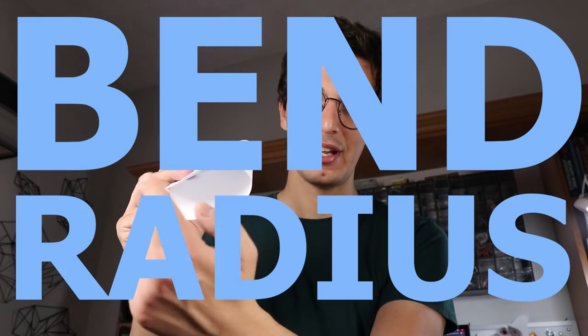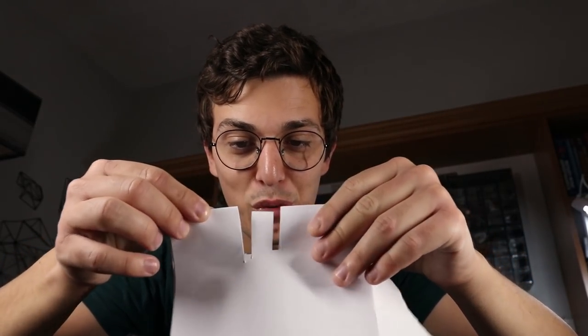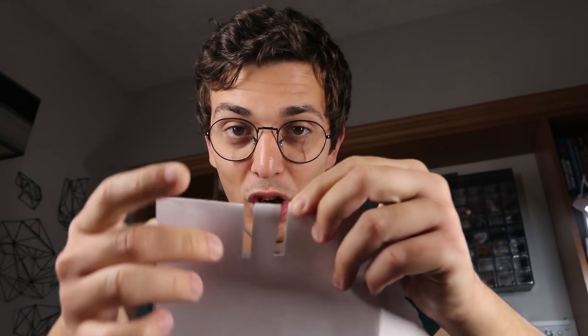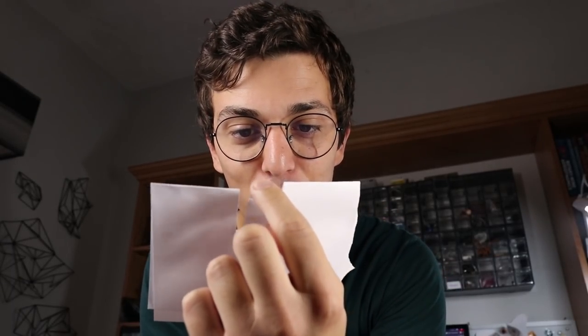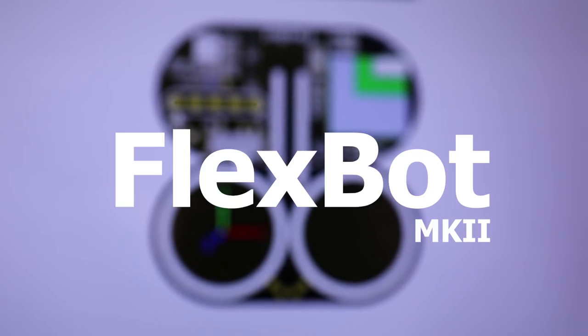We always need to have a bend radius. Here's where my breakthrough idea came about: what if these parts are folded and we have this little section where the tracks pass through, so they still have their bend radius and the whole thing can fold and act as a hinge? Meet my second version of Flexpot, which uses this concept.